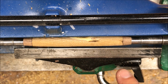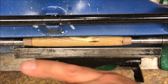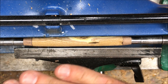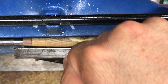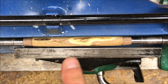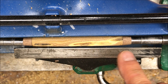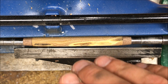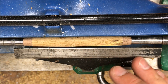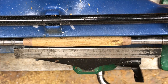And with that, we are ready to sand. You kind of saw the blank — did you notice how the blank seemed kind of dark and then as I ran the tool across it, it lightened up? What that was is my hands had gotten dirty from working with the sander and holding the blank, and I got that dirt on the blank and it darkened it up. That's one thing you want to be super careful of with these blanks — especially after I run the denatured alcohol on the blank, I always like to be super careful not to touch it. I'm going to go ahead and run through my sandpaper and get this sanded up, and I'll come back when it is sanded.